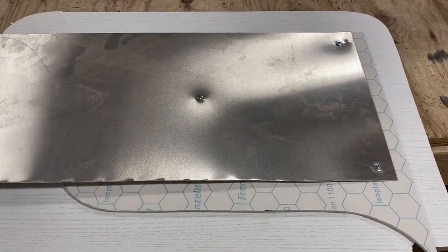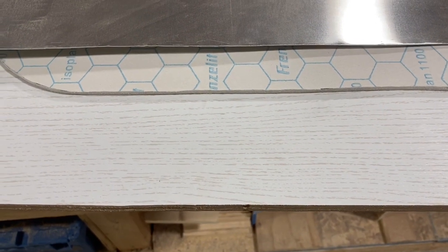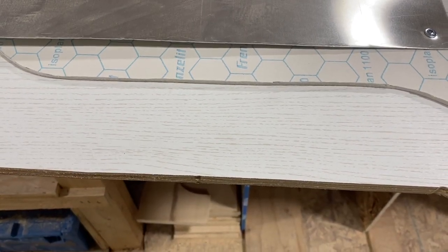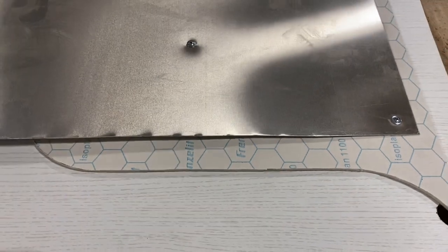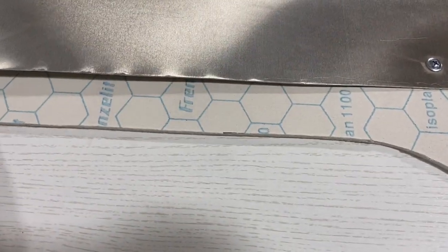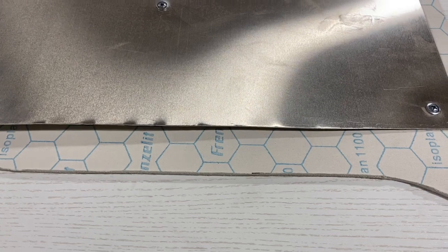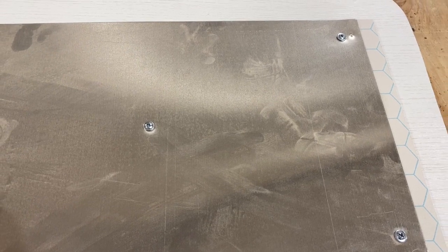These are the materials that we use behind our wood stove. We start with our wall material — it's a half-inch laminate, a vertical grade laminate on both sides with a maple core. Then you'll have a three-quarter inch framework and then either a 7/16th OSB outside sheeting or a 5/8 CDX outside sheeting, depending on what you want. We then go to what we refer to as a mill board — it's a fire backer, an eighth inch thick. You wouldn't think you'd get that much fire protection from it, but you'll see in this video how incredible this stuff is. Then we go to a stainless steel backsplash. We'll go ahead and light this — put a torch to it and see what the results are.